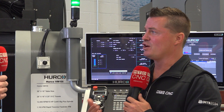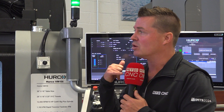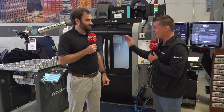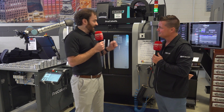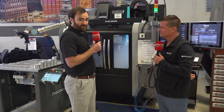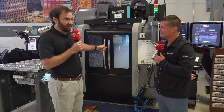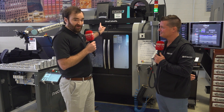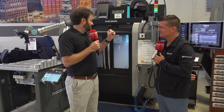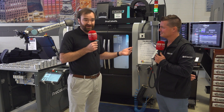Next question — you've already convinced the skeptic in me, so let me make this more difficult. I've invested in this machine, been running these parts for years, and all of a sudden I get a call saying there are no more jobs for the next six months. My cell doesn't have any work. Can I move it to another machine? Absolutely. In fact, at a show in October we demonstrated moving it from a mill to a lathe and back in about four to five minutes. It's easy because there's only one plug in the back of the machine — you unplug it, roll it on caster wheels to the next machine, plug it in, and as long as you have an auto door on that second machine, you set up your new part using that same five-minute setup process and you're running.